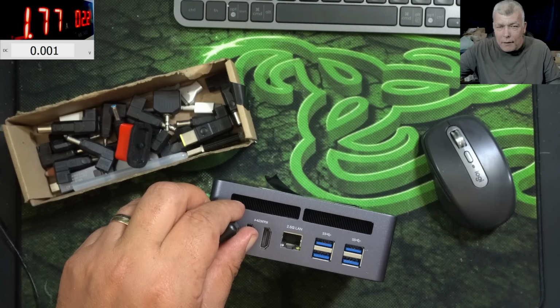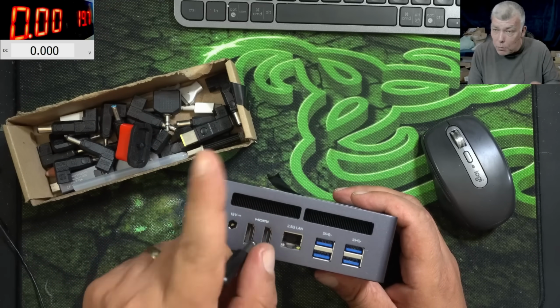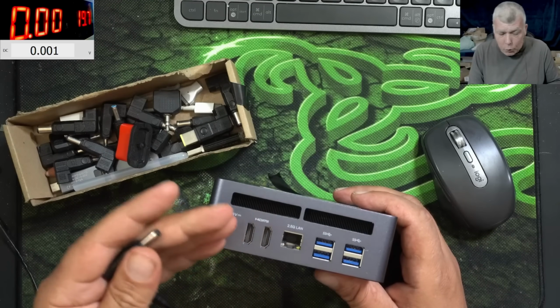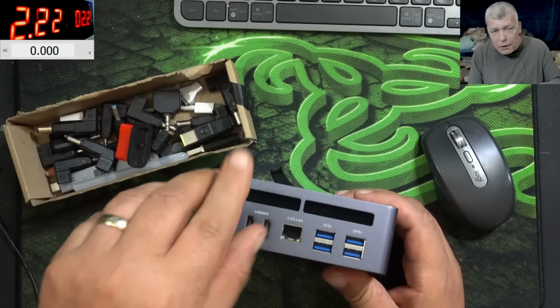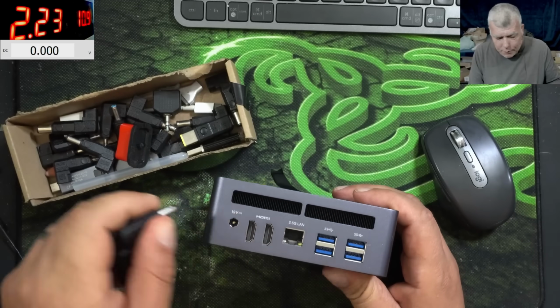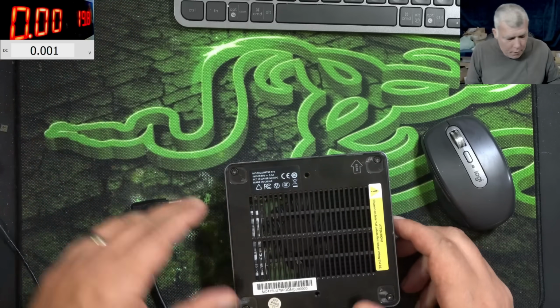Yeah, okay. No, the short is after the first two MOSFETs, or after the first MOSFET. I believe here is only one MOSFET, because you don't need a second MOSFET to prevent the battery power coming out to the charging port. So we have only one MOSFET. You can see the voltage is like 2.2 volts there. That means the short is not here at the charging port. It's after the first MOSFET. Good.